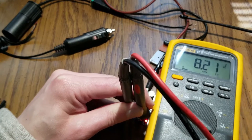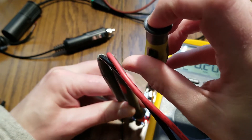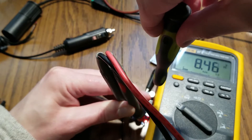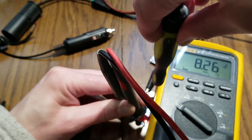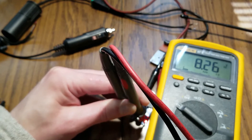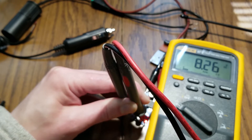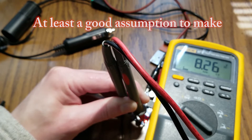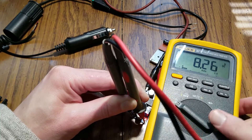I've got mine trimmed to about 8.2 volts - that's where I left it. You can spin the pot to vary the output. I'm going to leave it at about 8.2 volts; the device should see a pretty fully charged battery at that level. There will be some voltage drop, so if it's a bit much you can always tune it to 8.4. I wouldn't go really much higher than that though, because you're giving more power to the radio and there's no power limiting - the output transistor will heat up when transmitting and you could burn things out.